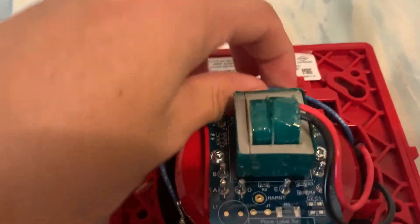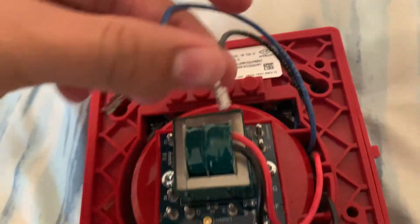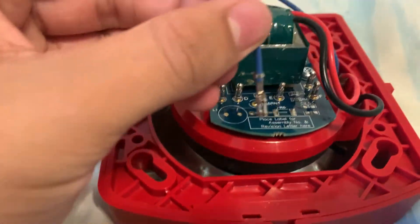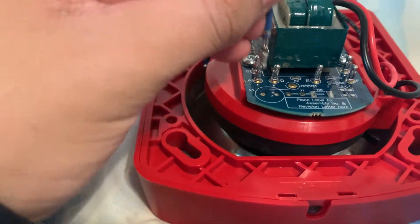On the alarm, there are these two wires that are hooked up to the speaker, to the pins on the speaker. This is your black wire that's hooked up to the common, and this is how you select your wattage. This is your 25 volt or 70 volt line, depending on your configuration — you'll select one of these according to your voltage.